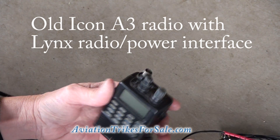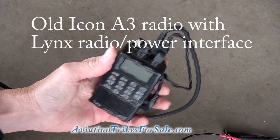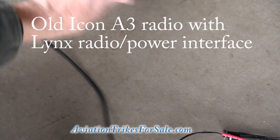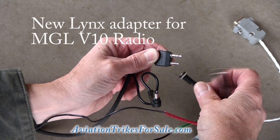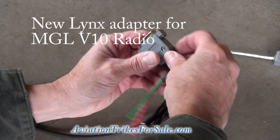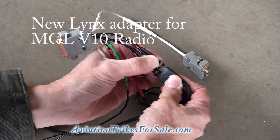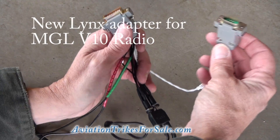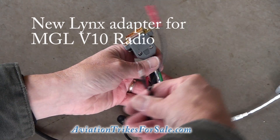Okay, here's the old system. I had an A3 radio, and here's your power input, your radio connection. What I did — got rid of this — built a little adapter here with a 3.5 millimeter stereo plug and a 2.5, being an adapter with the pins going into the V10 radio. This can plug right into our unit here and we're good to go. This goes into the V10 radio and this goes over for the communications to the Enigma. And here are your separate power leads for your radio.